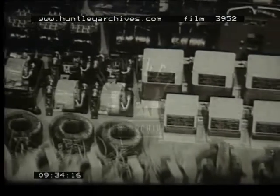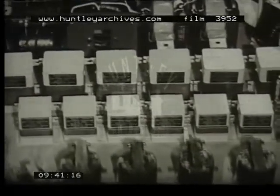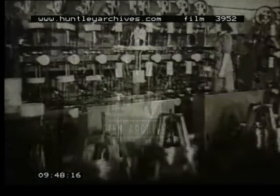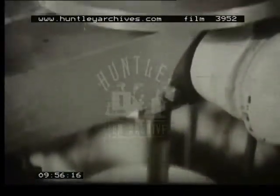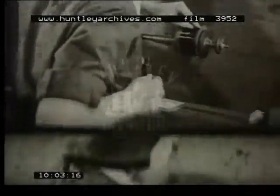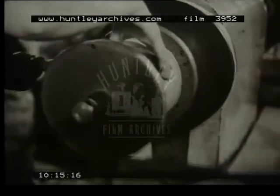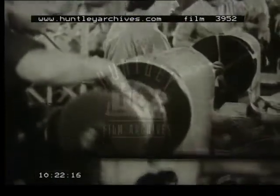It's a natural step from switchgear to transformers, which are made at the works of the British Electric Transformer Company Limited at Hayes, Middlesex, another of the CP group. Here is a collection of the babies of the transformer world — compare them with a larger one. The wire and strip used for winding are insulated with manila paper or cotton yarn. Insulation design is fundamental to transformer performance and is under the closest control. It takes a long time to make a good winder, and years of training starting from school-leaving age are necessary to acquire the technique. Blueprints and specifications are issued by the technical department, and every operator must be capable of using them. By far the largest percentage of the work carried out in this factory is of an individual, specifically designed character, so that operators very rarely have successive jobs of the same type.